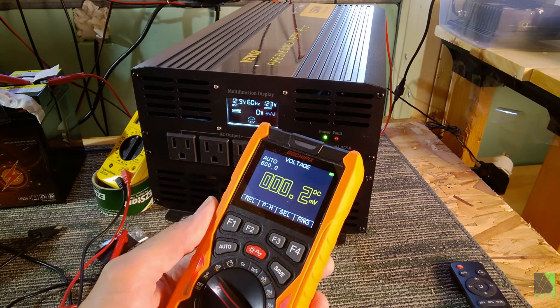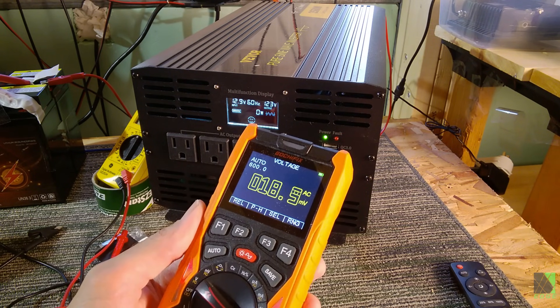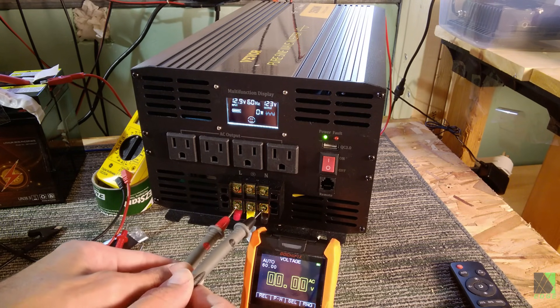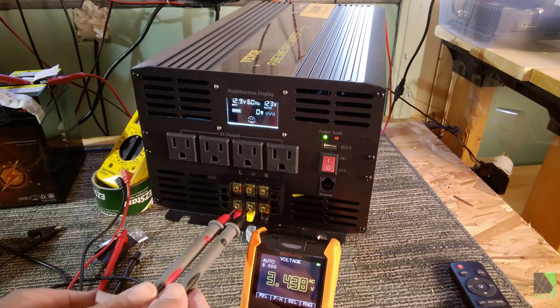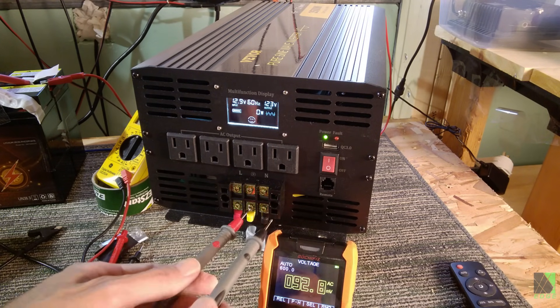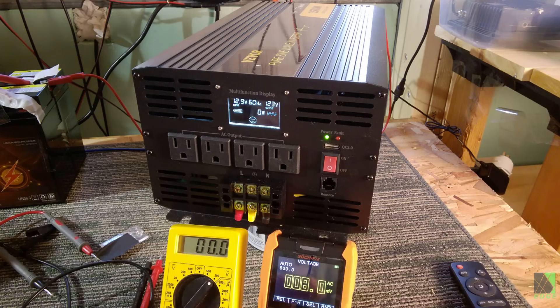Here's the original GochiFix 3-in-1 meter — I did a video on this as well, linked in the description. I'm going to set it to AC voltage. It's getting stray readings; if I short the leads it'll zero out. Let's measure between live and neutral — 120 volts AC. Now let's measure between live and ground, and you can see I'm getting 24 volts AC according to this meter. Isn't that strange? The last meter said I was getting nothing. Let's measure between ground and neutral — again, we're getting about 24 volts AC. Why is that? There are several different things going on here, and this is a reason why you need to slow down, pay attention, and do your own independent research.